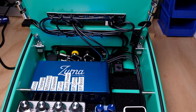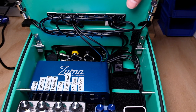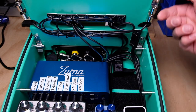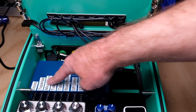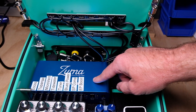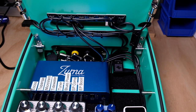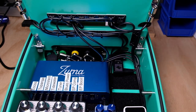Coming in a little closer — anything close to the sides I keep down low so when the top lid comes down, I don't have any cables running high or along the top of the power supply that would create a clearance problem. I always like to label each of the individual outputs on the power supply. It helps me keep track of what's getting power during the build, and once the board goes into service it's a helpful first step for troubleshooting if something's not getting power.